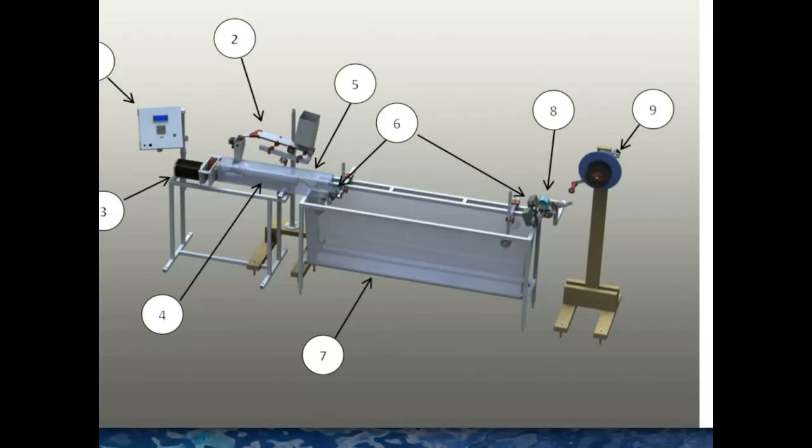It's pretty sophisticated. You haven't tried things like a screw auger because of all the problems with flakes jamming in there. Trust me, I would love to eliminate the star feeder. I think it really depends - historically we had very low quality flake. If we continue using the high quality flake we're producing with the chopper, I think we may be able to do away with the star feeder. It flows like pellets practically - it's very regular.